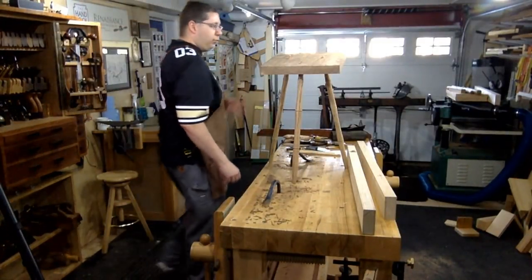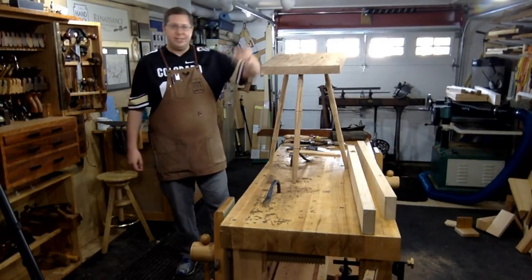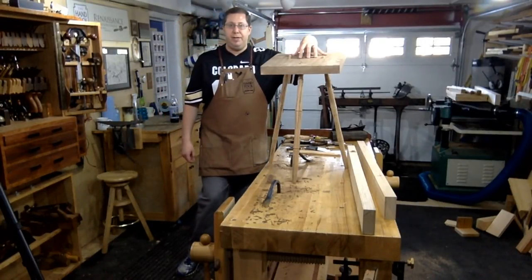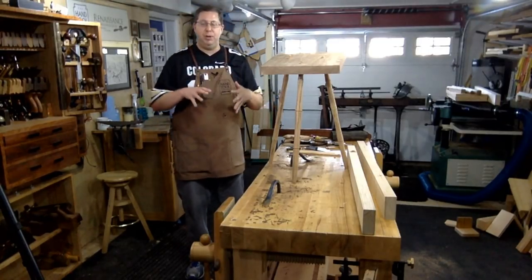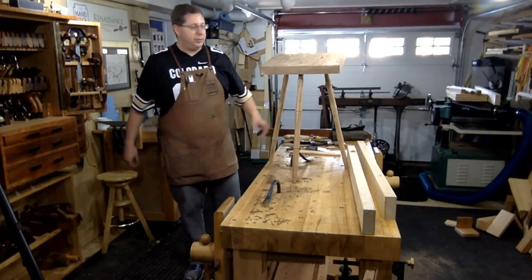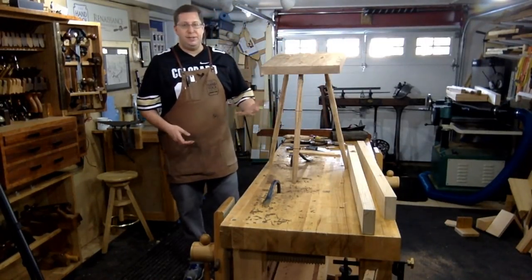It allows incredible strength with a really delicate nature. If you look at really nicely made Windsor chairs, skinny little spindles in the back, those spindles are made from the same wood that you're bending out of, and you can plane them down in the same growth ring, so they're super strong, yet super thin. They're also a little bit springy, so when you sit in the chair, it gives a little, it adjusts to you. Moreover, Windsor chairs, any of this plank and leg orientation like this, these are self-leveling.